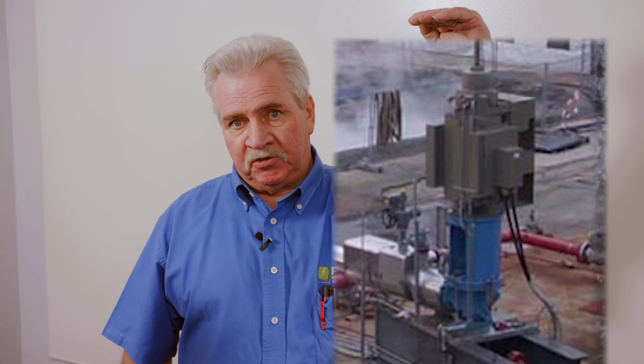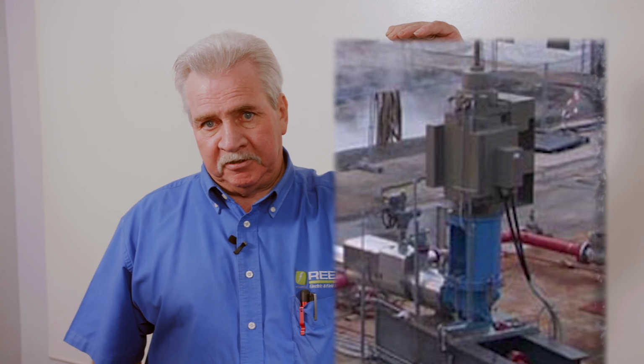So when they set the motor on it, and you know how big your 1500s are or 1250s, you got a sight glass now that they're trying to use a flashlight out there as an operator running by to see if the oil level is right. So they've had us install 14-inch sight glasses.